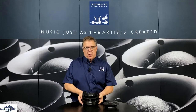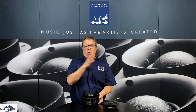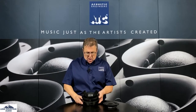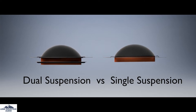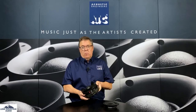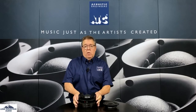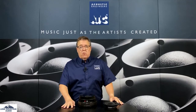With all these features built into this — a waveguide here to control the dispersion and keep it very consistent, this damped driver, and this short coil-long gap idea and the dual suspension — we can have a very low distortion part. It's a very significant addition to the ATC line. When you listen to a mid-range from ATC, it just sounds much clearer than what you heard on other speakers.